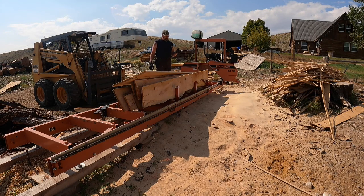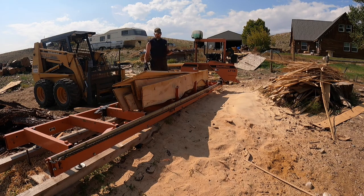So I've got one fairly straight edge. So what I'm going to do is cut the other edge at 10 inches, because most of these I can get 3 1x3s out of. Cut them all at 10 inches, get another flat side that's rough sawn, because I don't want a skill saw edge on the batts that are going to be showing. Then I'm going to flip them all over, cut an 1/8 off so I get a good rough sawn edge, and then start cutting my 1x3s out of that.